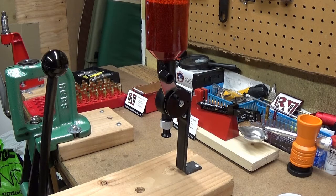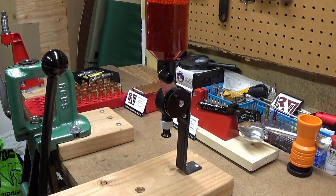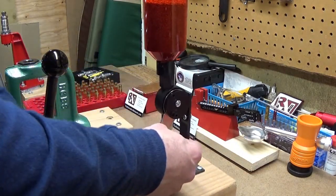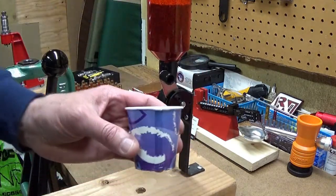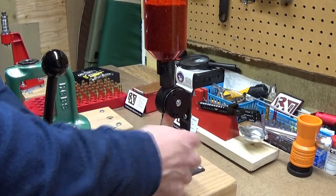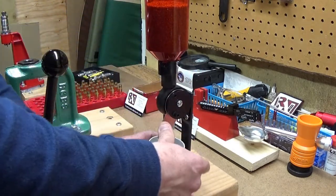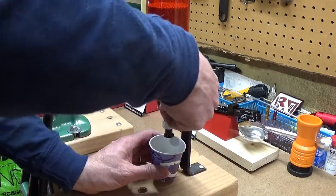I am going to try to make this quick. I've already put my powder in my powder measure and I have an approximate setting that I need to check. What I do is get my little Dixie cup and cycle the powder measure usually about 20 times, kind of slowly and carefully, mostly just to get it settled and make sure that I've got a good flow going through it.